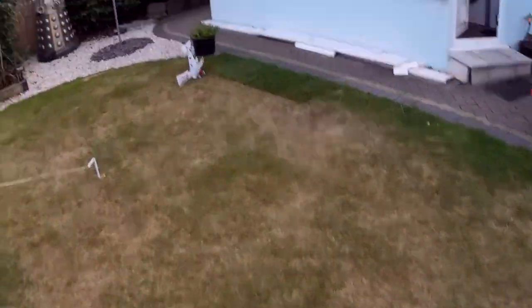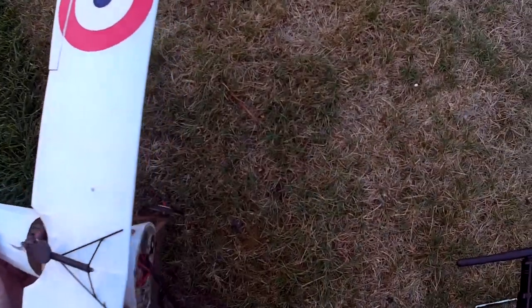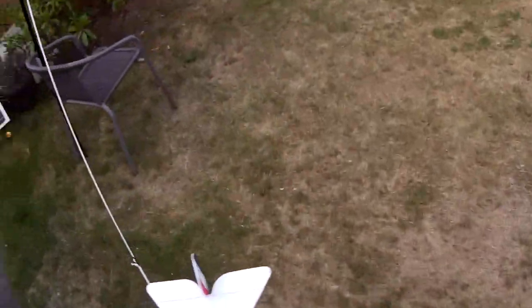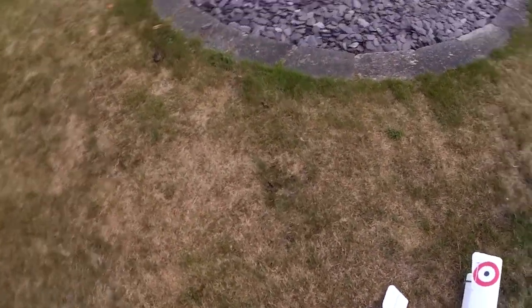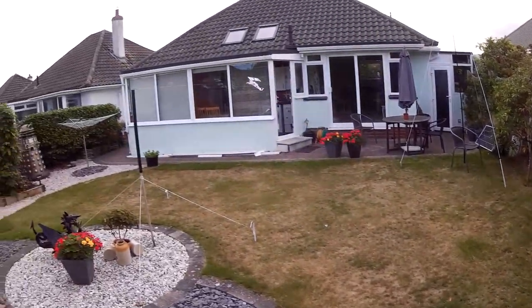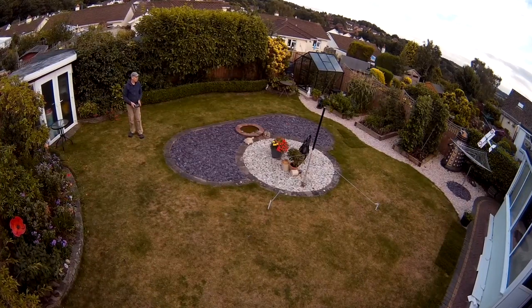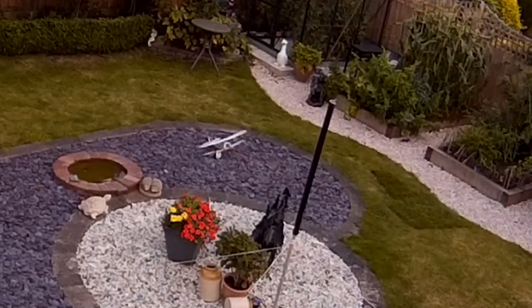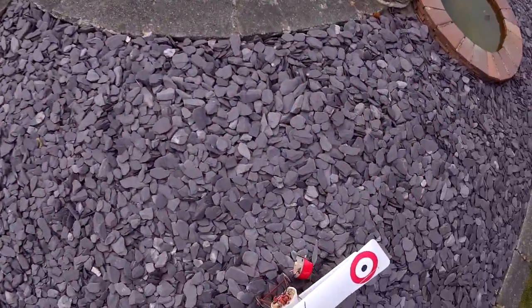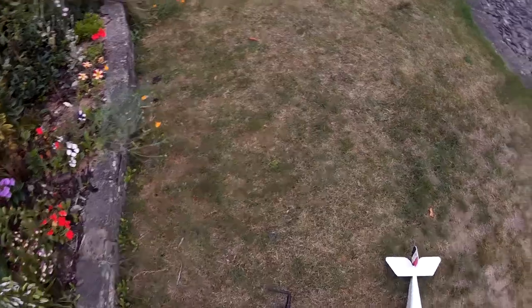Oh, shut the floor quick - that looked decidedly tail heavy didn't it! Perhaps the lack of airspeed didn't help. Let's try that again - this time we'll dial in some down elevator. In fact I held on full up, perhaps I shouldn't. Okay let's try it again. It's dropping steeply there. Let's check her out - attempted to add a bit more nose weight on it actually. I put some nose weight on. Maybe it's the drag of the line, we'll have a go.